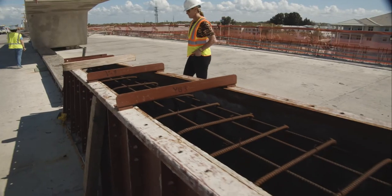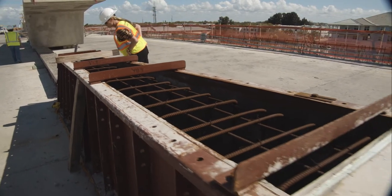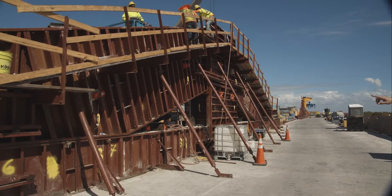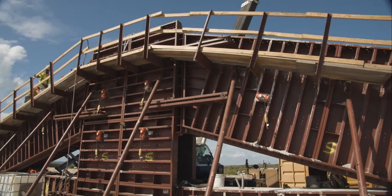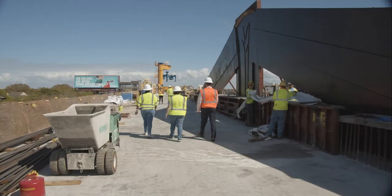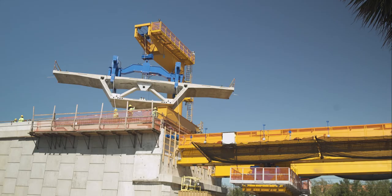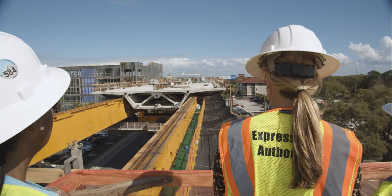You can see the amount of steel that goes into any one of these barrier wall sections. They use external vibrators that actually shake the forms — it helps the concrete fill all the voids. The pivot crane will pick them up and literally pivot out over the steel truss system that you can see to my left.